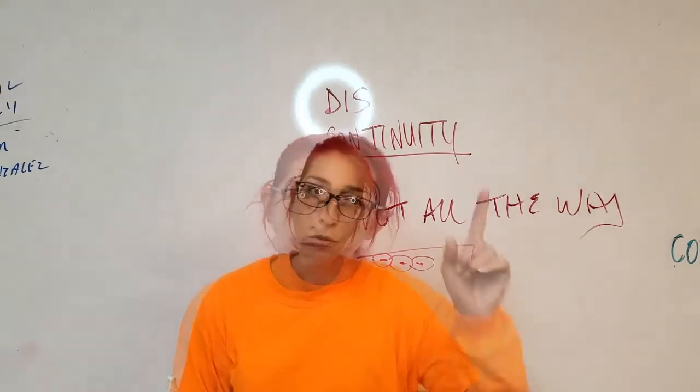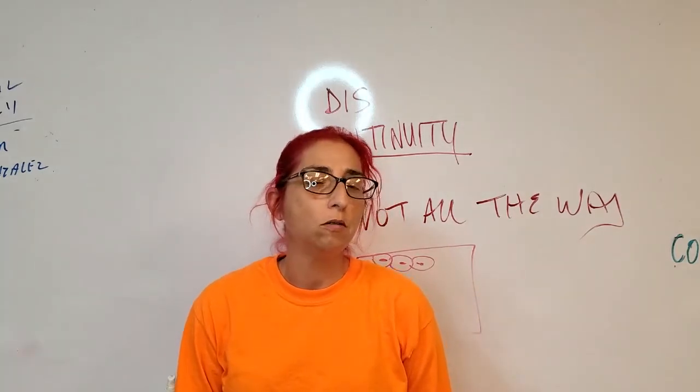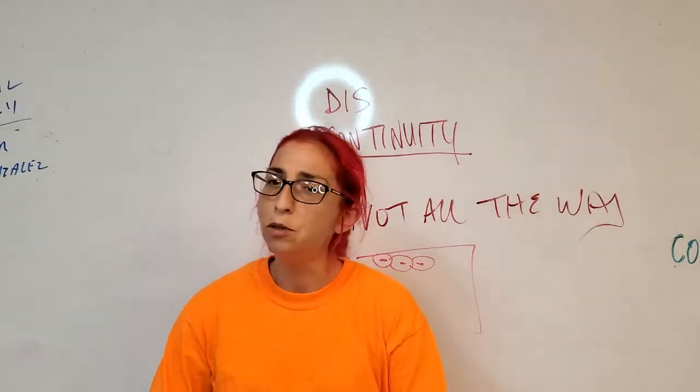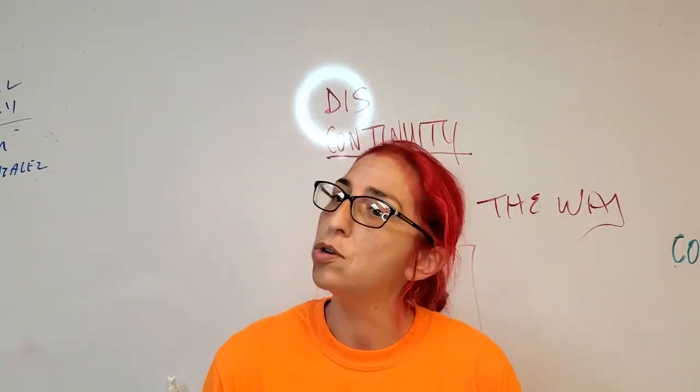Yes and no. Travel speed. Ooh, okay. Where do we normally see undercut? We'll see it on the edges, on the edge of our toes. And usually this will happen in vertical and sometimes even horizontal.